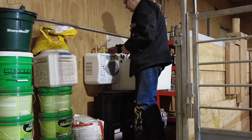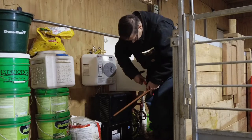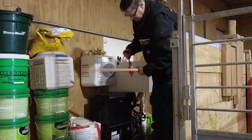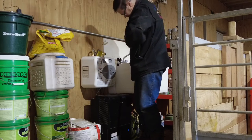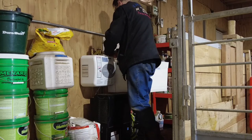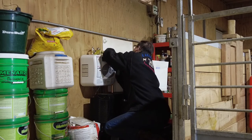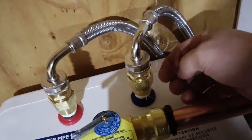After fixing the small leak, I extended the pressure relief line — I used three-quarter inch pipe and ran it down to the ground so if the relief valve ever needs to activate, it drains safely. It had a 90-degree elbow and a threaded side — I think it's three-quarter NPT threading — so I put a SharkBite fitting with the three-quarter brass end, screwed it in, added the 90-degree elbow, and that's all set. I didn't have a formal inspection, but from my local codes this appears completely legal. It's more than two feet away from any electrical outlet, and the outlets are GFCI'd, so we're good.